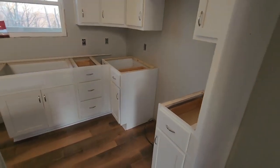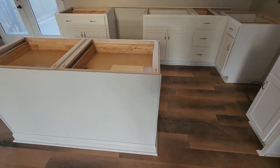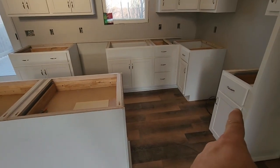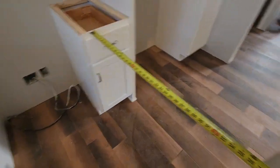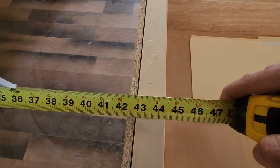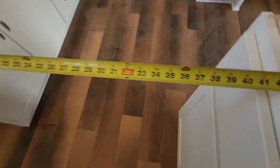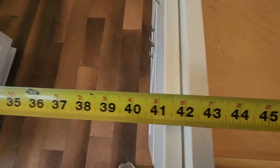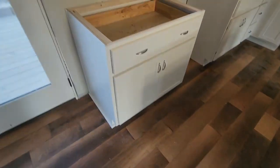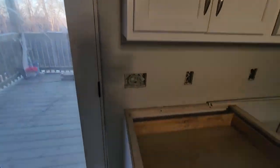For hot and cold adjustments, I got the baseboard around the island. We set the island at 42 inches off this cabinet and 42 inches off that cabinet. So this should be 42 and a quarter because of the quarter-inch overhang, and then we got 42 to the face frame here, 42 and 42 to the face frame there.